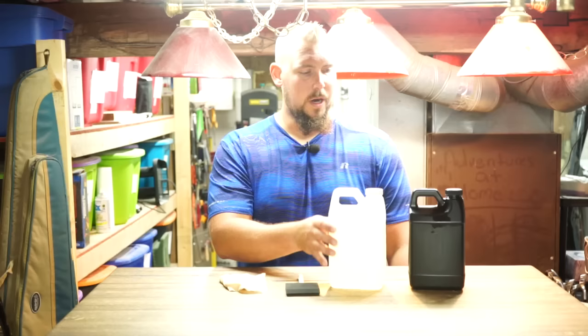This stuff is kind of contrary to what you'll read online — it's kind of a pain to work with. But the results are worth it, especially if it's going to be for a table top or a counter top. It's ultra durable, way more UV resistant than polyurethane, and it holds up a lot better if someone doesn't use a coaster. And if the finish gets nicked, it's a lot easier to just sand it down a little bit and put another layer on to refinish it.